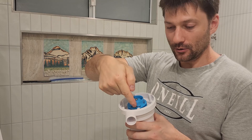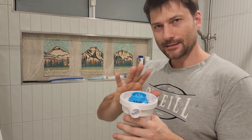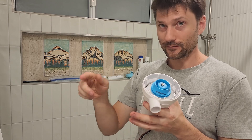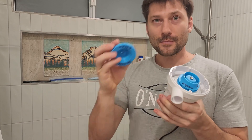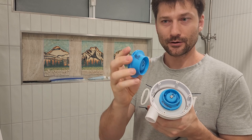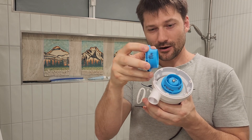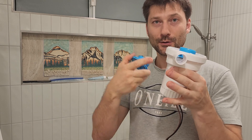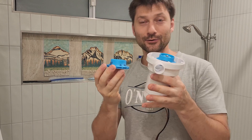The next step would be to build a nice little snail-shell volute around this to make it even more efficient — that's after I test impellers. My theory is that this should draw about the same wattage but be slightly more efficient. I have another impeller here: the total diameter is much larger so I should be able to get higher pressure out of it, but these little slots are thinner than those slots, so I'm pumping less water but at higher pressure — hopefully so I don't burn out this motor.